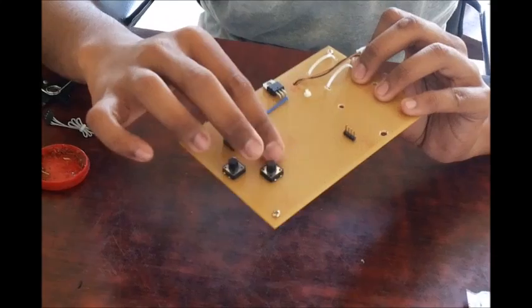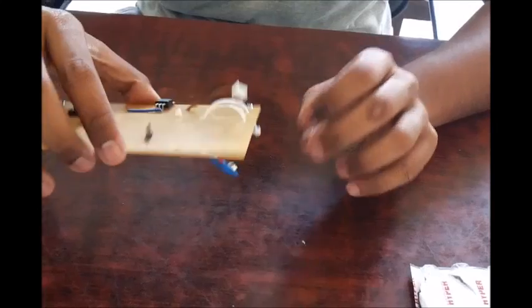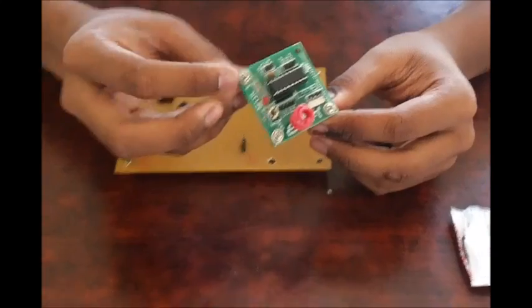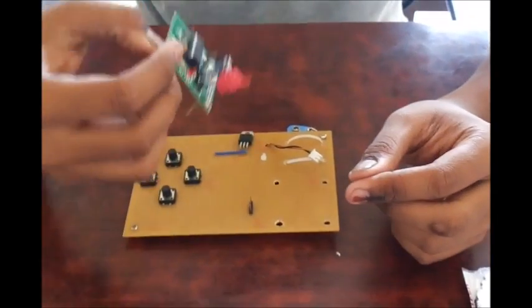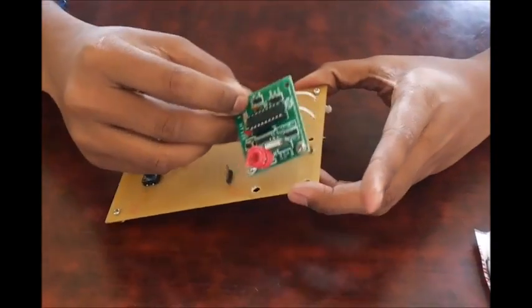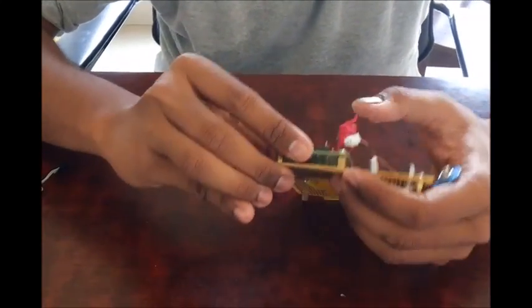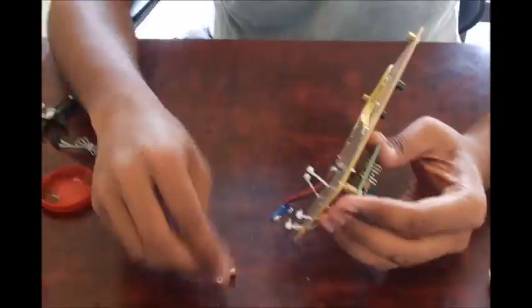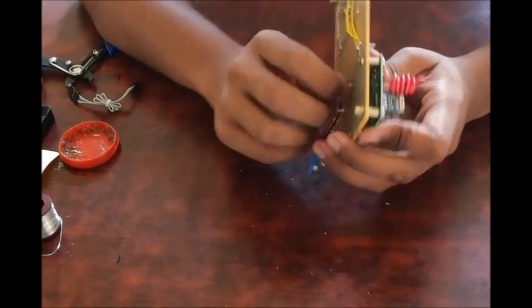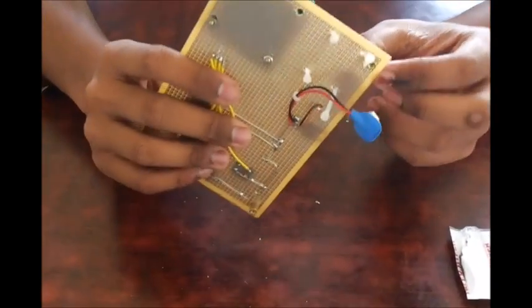This is D0, D1, D2, D3 — they will then send this 4-bit data value over here, which you can see is a bus strip. Now I am going to connect the RF transmitter. This is the RF transmitter circuit. Whatever circuit diagram is provided at the website is made into a PCB here for simplicity, but you could always make it on a general-purpose board like this one. I have already screwed on the spacers.